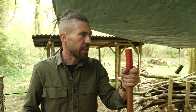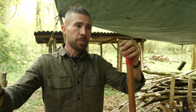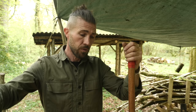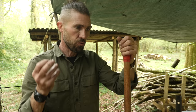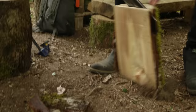What other wood species would be good for this, not just in the UK but worldwide? We're using ash today but it's not known as an external wood. If you had a low pitch you wouldn't want to use ash because it would hold water and rot, but on a really steep pitch it would be fine. Sweet chestnut is a very good wood for shingles - it grows tall and straight, you get some really clean rings, and it contains tannic acid the same as oak, so it has its own natural rot resistance. If I were going to make shingles from any species I would probably choose sweet chestnut or oak.